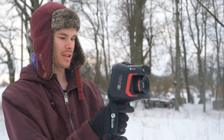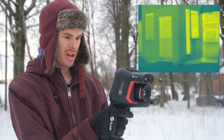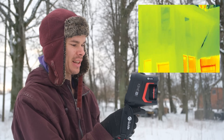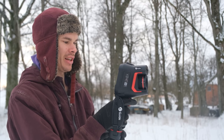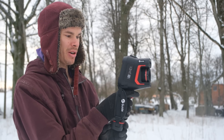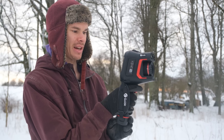The tower has absolutely no cold spots — there's a small amount of heat coming out at the foundation. I already looked at that and the foundation with the heated floors does lose a bit of heat, but realistically not much. The house overall doesn't have much leakage. You can really see the separation from the living room to the storage room, which has a huge temperature difference indoors — you can see the walls glowing a bit more with a few degrees difference.